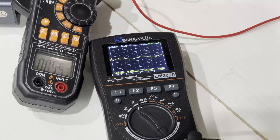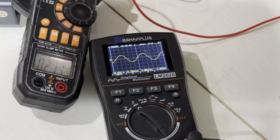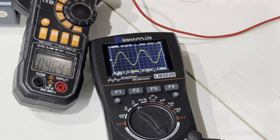Now it's time for the amp dyno, one of my favorite parts. We're using the included power supply — all the testing equipment is linked in the description. We're running a 1 kHz signal and watching for where the amplifier starts to clip. Once the oscilloscope starts to square off, we know we're hitting distortion. Right about there: 15.8 volts and 4.6 amps.